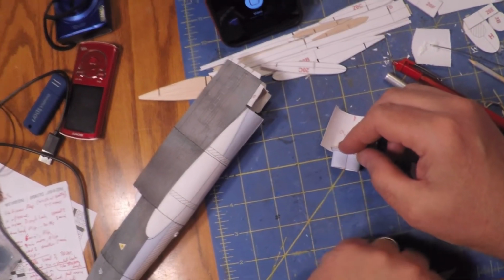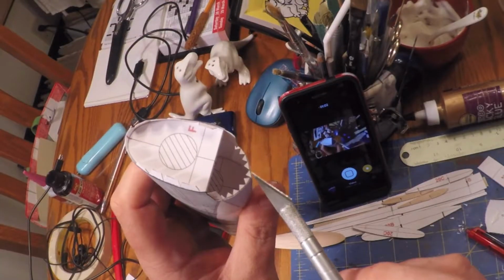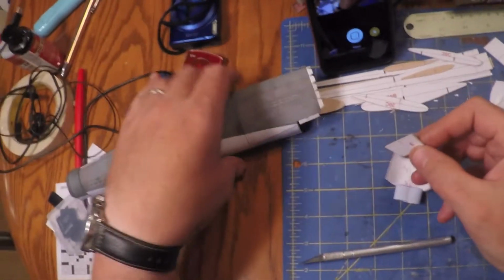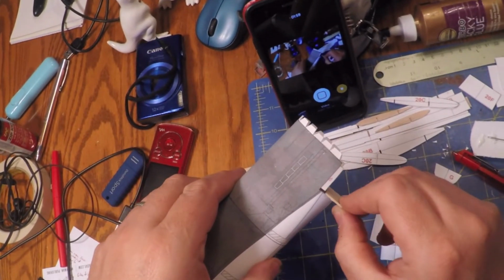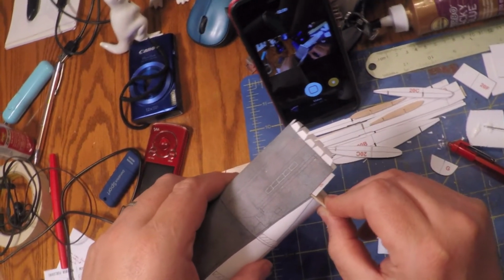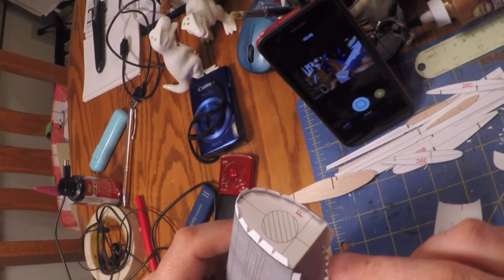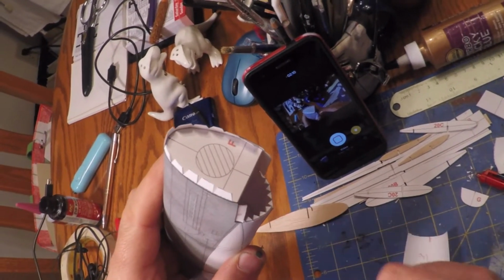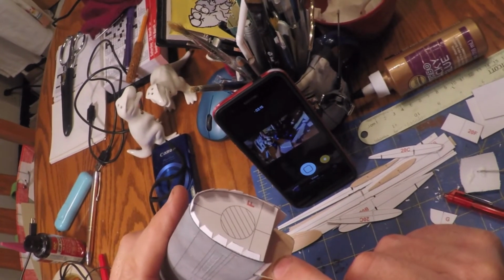So that's how it's going to go, but after playing around, I found that that's not the way to do it. This piece can go in the front, and these little teeth, I had no idea what they were for, but what they did in the previous former was you put them in vertically and didn't leave them out. And what they do is give glue surface for that piece. See how that's going to go in on those sides, and those teeth are glue surface, which again, I was so confused. I had them sticking out, and I could not figure out how on earth they were working. Then I realized that's what you do with them. So see, they're giving you a little shelf to put that on.